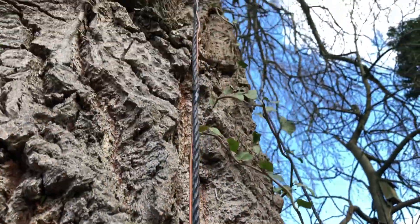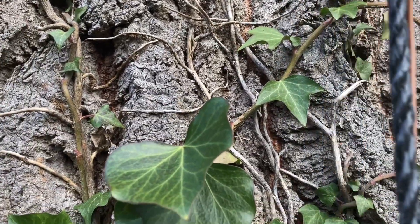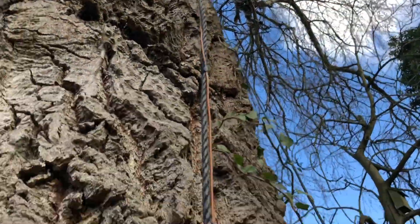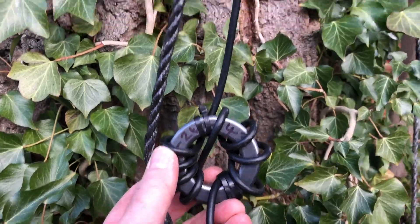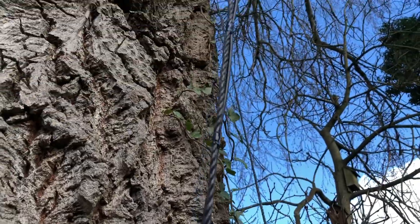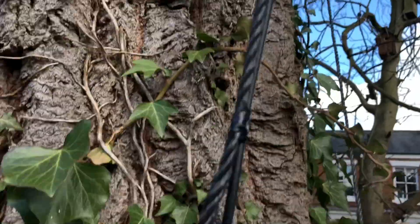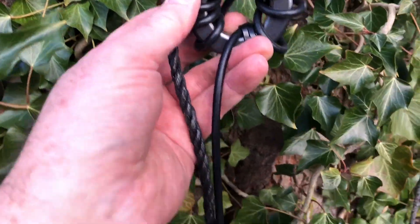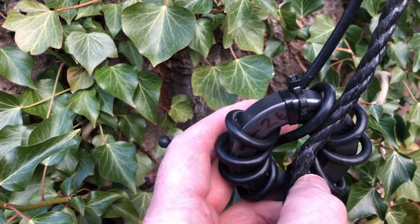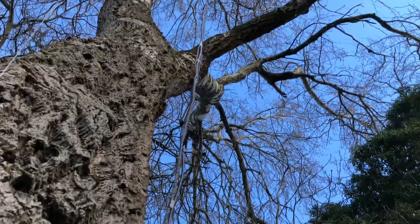Now onto the brown flex — if you remember from the first video, this was a very cheap build made from mains cable split, so there's brown and blue wire — the cheapest of the cheap. You can see now I've got to the base of the antenna: the coax RG58 goes up to the Westflex stub. This is the end of the antenna — there's a little bit more coax with a PL259 on, and I'll attach the RG213 to that and then keep pulling up until I get to the very top of that branch.